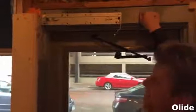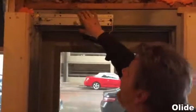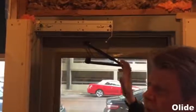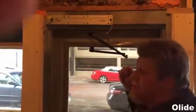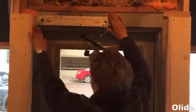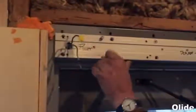This is a hollow steel casement frame, and what I did to beef it up is I put 2x4 spanners inside. You want this to be strong without flex because these are high torque motors. They will stop if they get any resistance, but when they close they close the door tightly, so you want this flex-free. The rule of thumb is your left edge will be flush with the casement and the bottom will be flush with the casement as well.